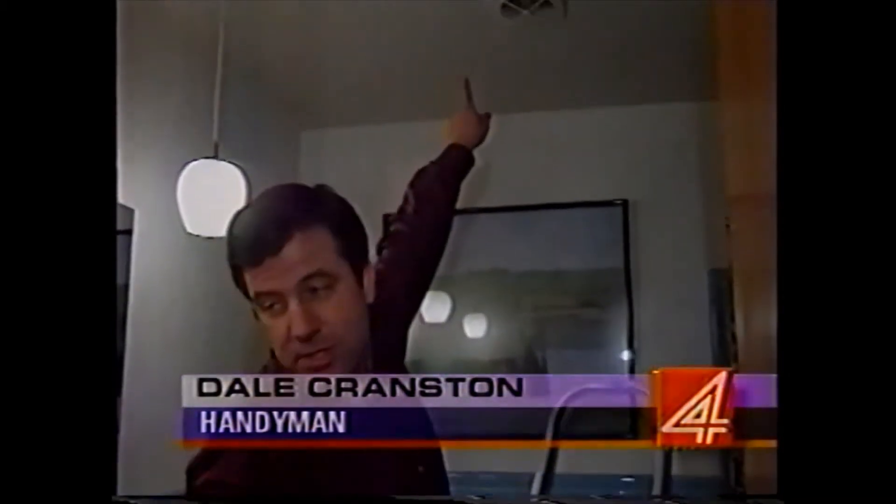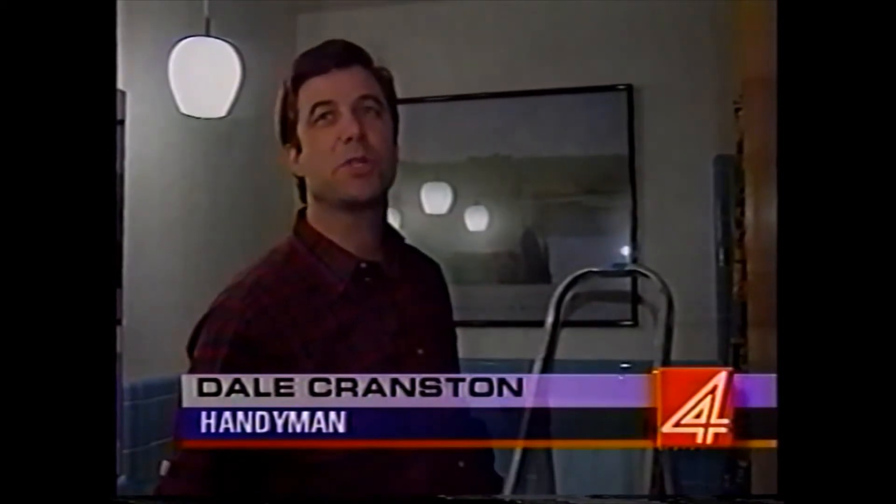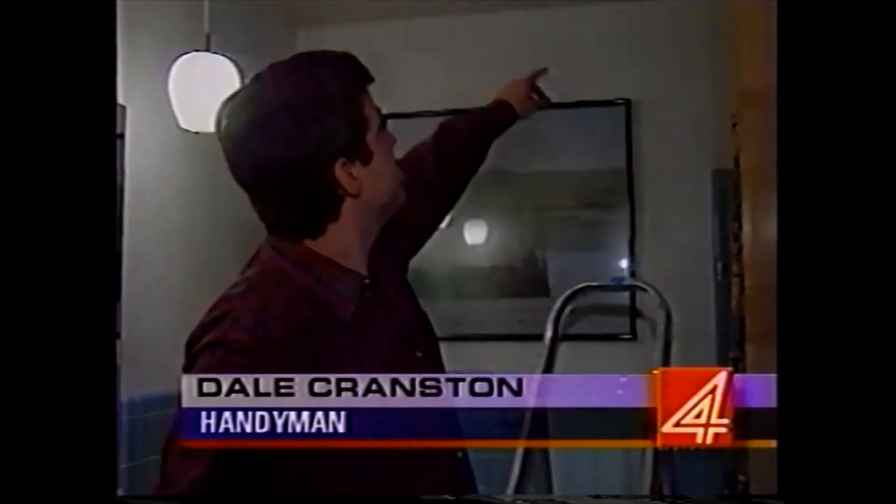You say you don't even know if you have one — I have to go down and look. Now it shows us how to get rid of the old noisy one with an improved quiet one. This Saturday, we're going to put in a new bathroom fan. You can see up here we've got one of these old style small, little noisy fans — this is basically ineffective. We're going to put in a new low-sone, 100 CFM bathroom fan that's really going to draw, and we're going to ventilate it properly.